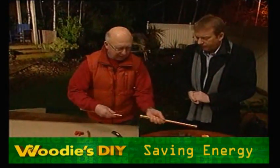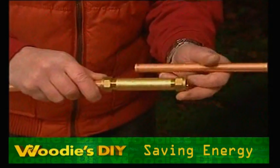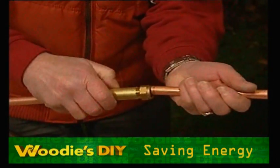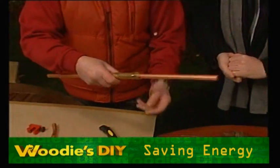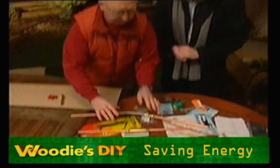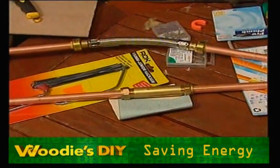This is a different one — a rigid one. Normally a connection for a copper pipe, the pipe just goes in that much and stops. And if you try to cut a pipe that's rigid and fixed to the wall, you can't get it on. But this one slides right down, so you can put it down and slide it back up again. Then you tighten the two with the spanner and that's it completed. Those two pieces of ingenious work have made it simple for everybody to use.